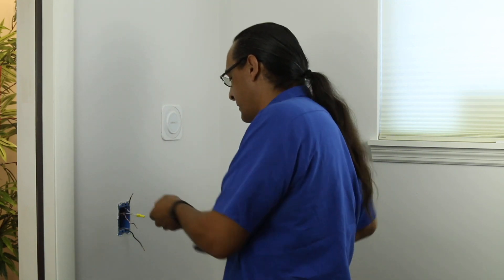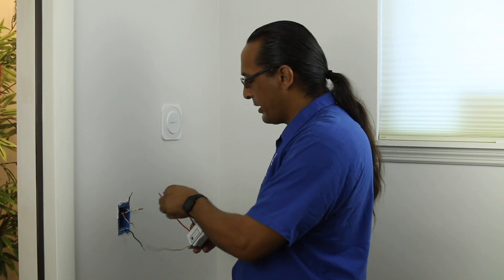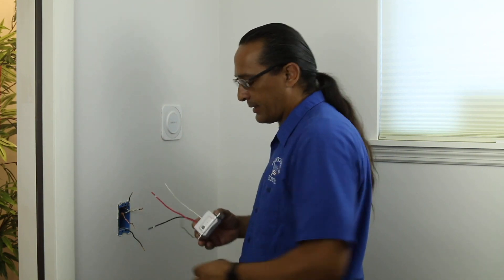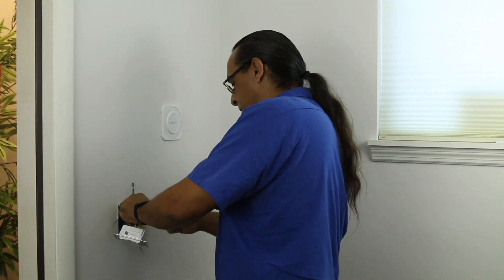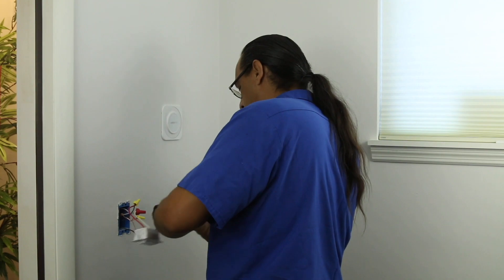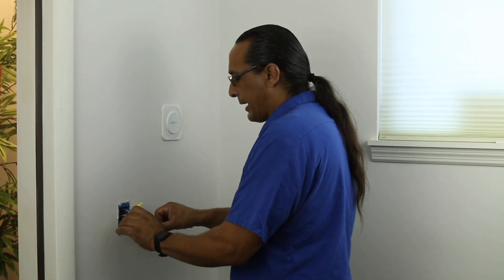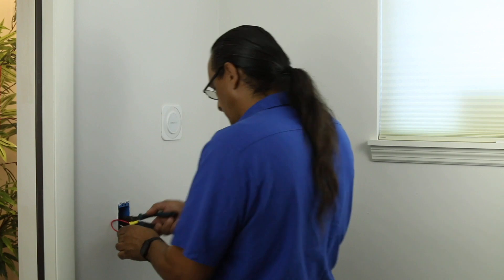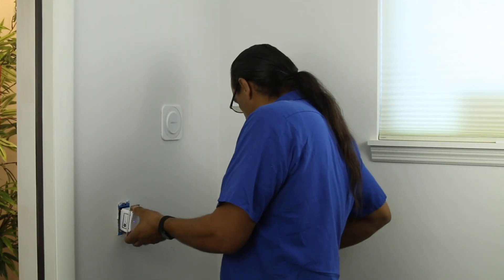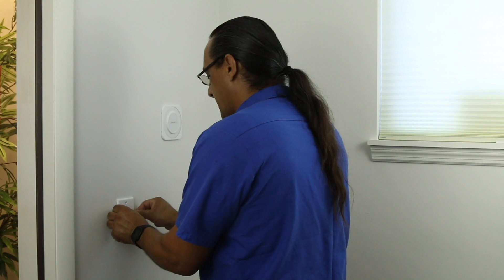For our iDevices we'll need our line, our load, our ground, and a neutral wire to make the switch completely operable — we need those four things. We have our switch and we're going to connect it in the order of ground first, then neutral, then load, and then line last. Make sure you get a good twist on the wire nuts — we don't want them coming off. Once all the wires are connected, get them back into the box with wires tucked in the back first, screw it in, and lastly install the plate. Installation is complete.